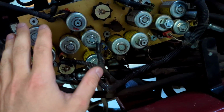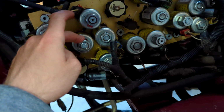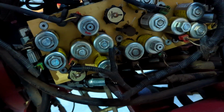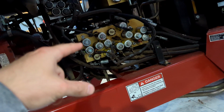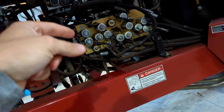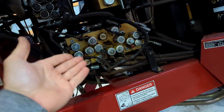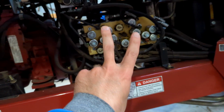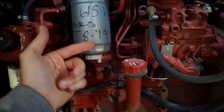And now, just recently here, another master valve went bad. So that's 2 OEM valves that went kaput. This is kind of a known issue with these machines, the valve block here. They like to blow seals on the valves, backing rings, and I guess the valves just like to break on these things. Like I say, I don't know about the original owner before us, because we bought this machine when it had 615 hours on it back in 2019.